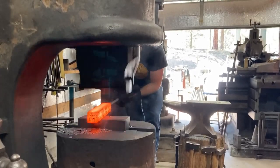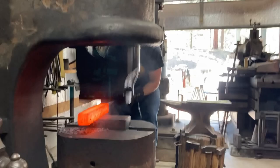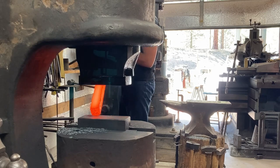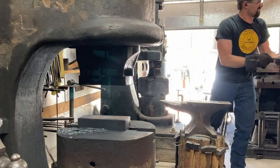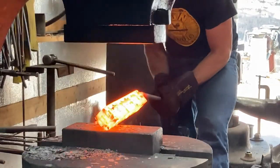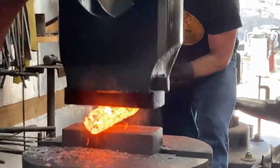There are a lot of things I will speed up for the sake of brevity — who wants to watch a bandsaw cut for ten minutes — but I don't plan on ever speeding up any of the forging I do. I find it soothing to watch and soothing to do. If you really want to learn how to forge by watching this stuff, there are little cues you're going to pick up on here and there. Giving it another little soak on the third heat, with a heavy cross section, we're knocking the corners down and going for a 45-degree re-square, forging it on the bias as they say.